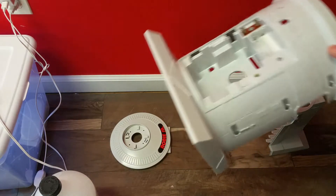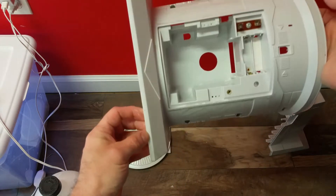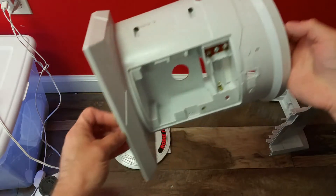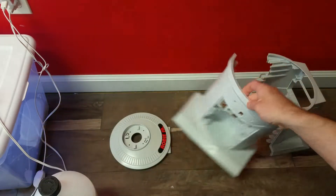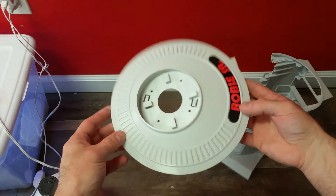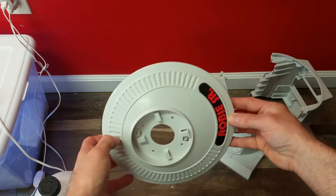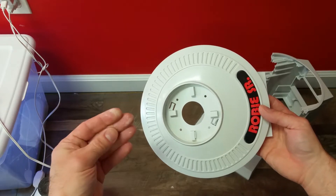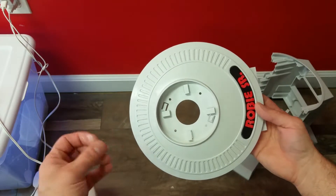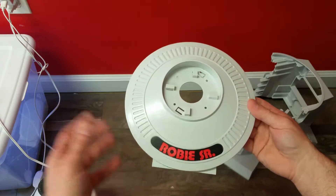Once your parts are done, you'll want to rinse them in warm water and maybe take a paintbrush to get all of the hydrogen peroxide residue out of the cracks. I took as many electronics and wires off as I could because the hydrogen peroxide will cause corrosion if it touches them, and of course by cleaning it with water you're going to have that problem as well. The cleaned part should come out looking nice and smooth once you get all the water off of it. This one hasn't gone through its final bath — it's a little bit on the yellow side and is going to take another couple hours under the irradiation. Make sure you wear gloves — this stuff will eat right through your skin. It's really powerful hydrogen peroxide and it burns the heck out of your skin. Wear work gloves or industrial gloves, and if you get it in your eye you'll never forget it. So make sure you're wearing gloves and eye protection.